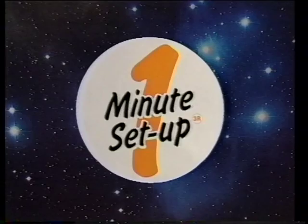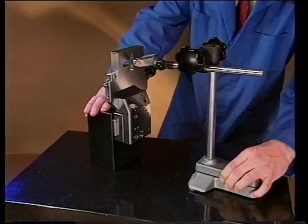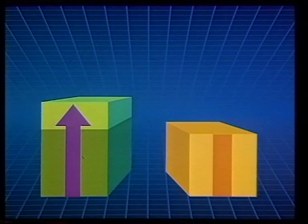Thanks to our fixed references, we can lift out the holder with the workpiece and check the accuracy at any time during the operation. By reducing the setup times, we can increase production time, which means improved profitability. The left-hand block here symbolizes the machine investment, while the right-hand one represents the degree of use without accessories. By investing in System 3R concept wire EDMing, you can dramatically improve the degree of use, productivity, flexibility, and quality.